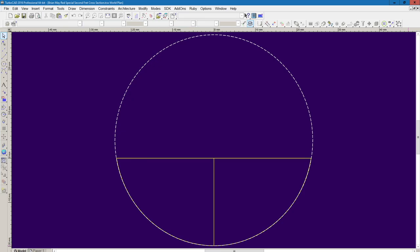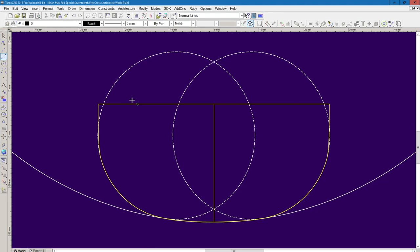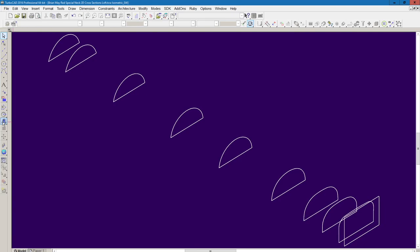The width and depth measurements at any given point are set by the design sketch, and as you construct these cross-sections, it becomes evident that there is a natural transition point where the profiles can be derived from a single ellipse to those which require 2 offset circles with a 3rd larger circle to fill the gap at the apex. In my design, the 8th fret was a pure ellipse, and the 12th fret 2 circles, so the transition point must be somewhere in that range.